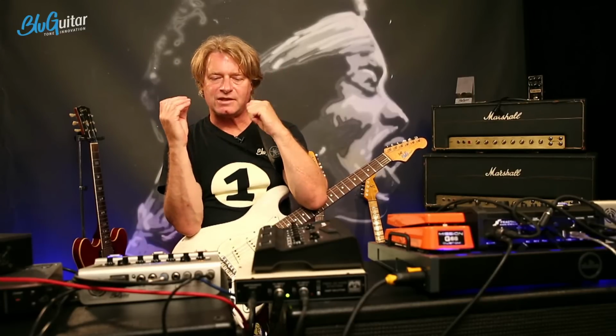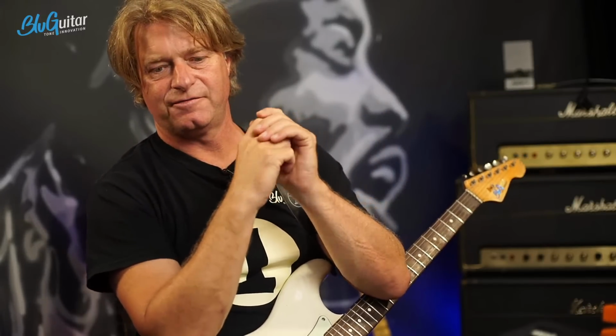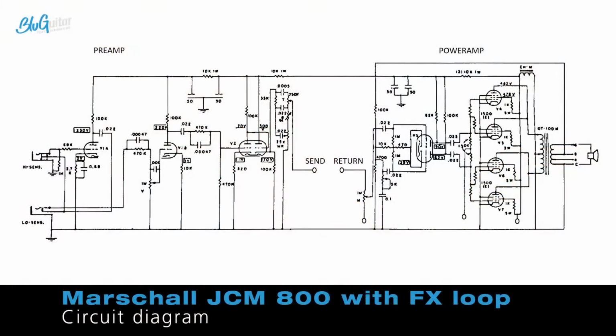And here comes the history of the tube amps. Let's show the diagram of a tube amp again, which we saw at the beginning of the episode. We can see many tubes in the signal path. There is the first tube that is two halves of a tube, and then you see another tube which is in one bulb, which is the cathode follower stage in the Marshall. And then there is another phase inverter splitter tube before the four power amp tubes.